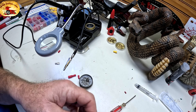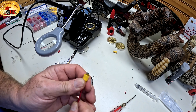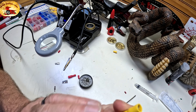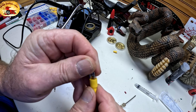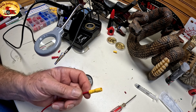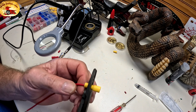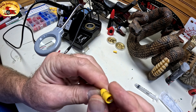Take your original terminal cover that you had taken off and you can pull it right down in there — it will not come out of there; I'm pulling pretty hard. Press it down — it's nice and flush. These terminals I'm using are really good quality and very affordable as well. That'll go on like that. Much cheaper to do this than using shrink sleeve on top of it, plus it's much stronger and harder for it to wear through. That is as good as gold.